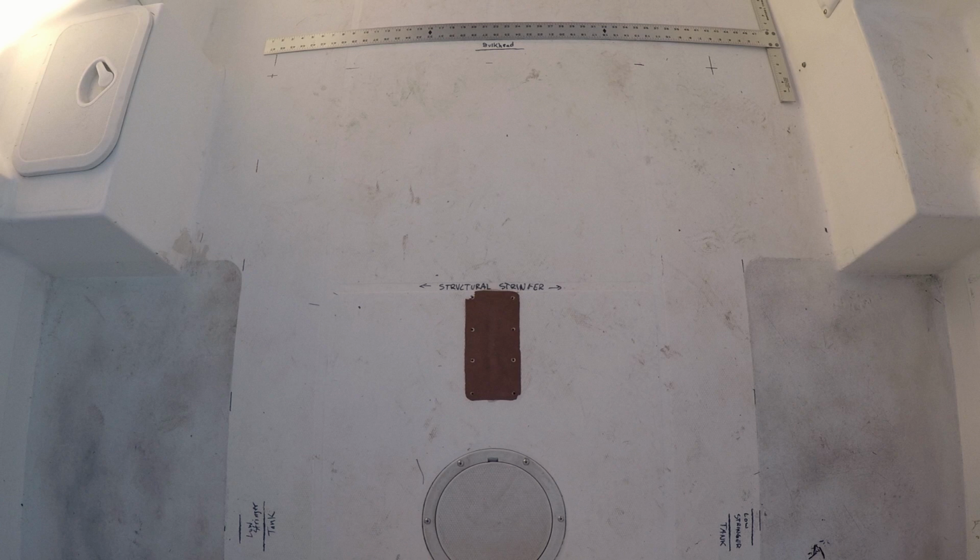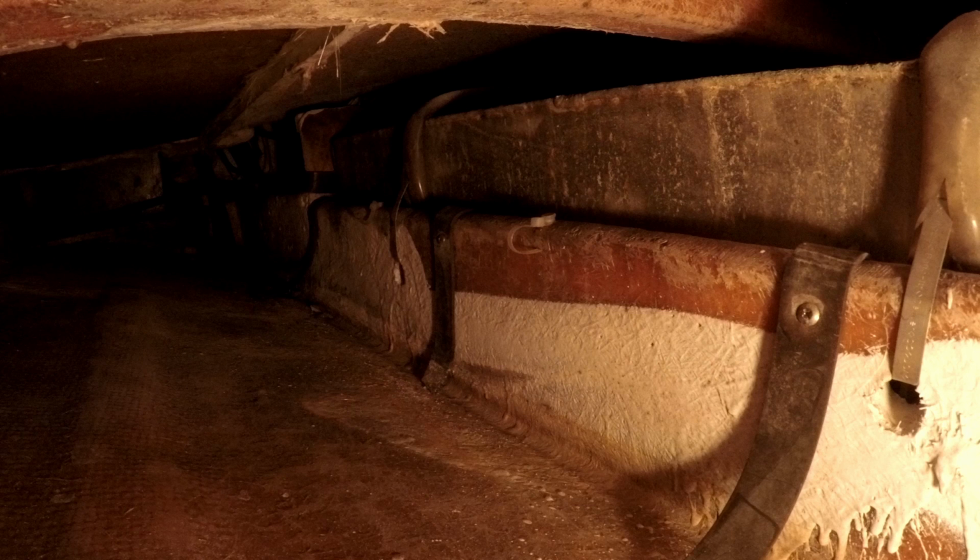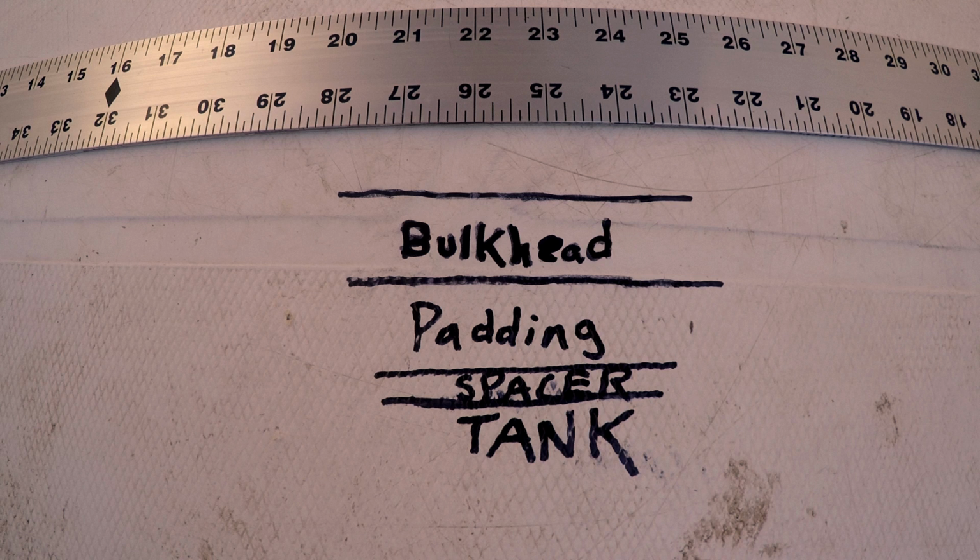Here you can see where the fish lockers were removed and non-skid texture applied. Notice the position of the 2x3 and the forward bulkhead. We can clearly see the edge of the fish lockers, so the side cuts will be simple enough. The stringer is well below the tank, so I'm not concerned about cutting it. We should be able to reach the outside edge of the stringer tab area for better access under the deck. I will take more measurements to confirm the exact placement of the bulkhead.